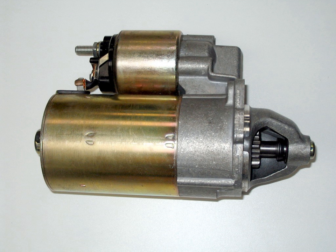Before Chrysler's 1949 innovation of the key-operated combination ignition starter switch, the starter was often operated by the driver pressing a button mounted on the floor or dashboard. Some vehicles had a pedal that manually engaged the starter drive pinion with the flywheel ring gear, then completed the electrical circuit once the pedal reached the end of its travel. Ferguson tractors from the 1940s, including the Ferguson TE20, had an extra position on the gear lever that engaged the starter switch, preventing the tractors from being started in gear.